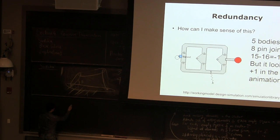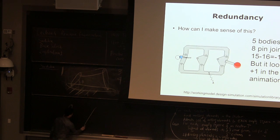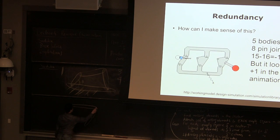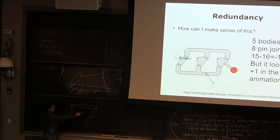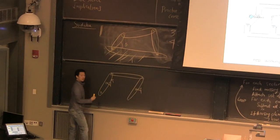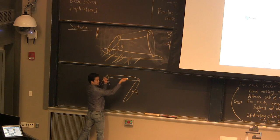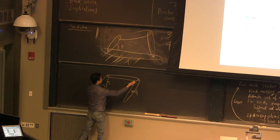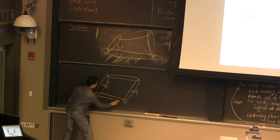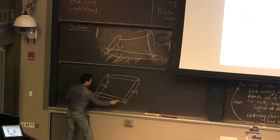This is one of the examples. Linkages like this, and then there's another linkage like this. Typically adding one linkage like this, and then rotating this is enough to rotate this one. If this is anchored on the ground, it's anchored on the ground. But I want it to be stronger. When I pull this handle it resists the pulling force really well, but when I push, this might crumble, it might buckle. So I want to add another joint at the bottom. As long as these are perfectly parallel and the lengths are exactly the same, it will still move.